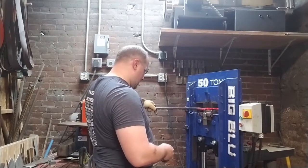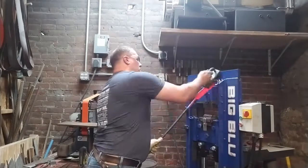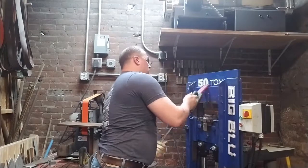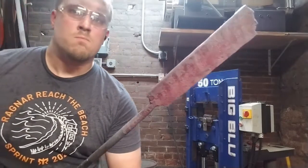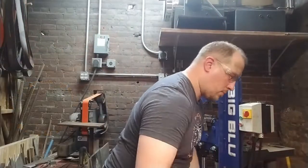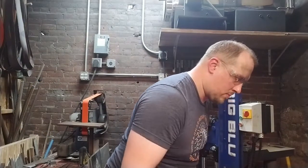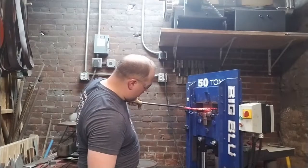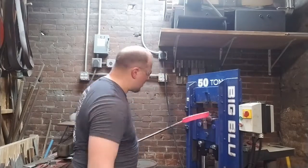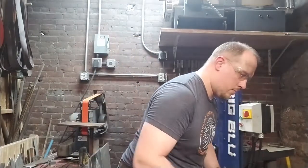and you want to make sure that you go back to the anvil and reset those welds, because again, diffusion welding is a function of pressure, heat, and time to allow those surfaces to intermingle. And if you have pressure in the opposite direction, away from the plane of the weld, you can pop those diffusion welds apart. And that happens very easily in smithing, especially with fairly primitive steels and historic construction techniques.